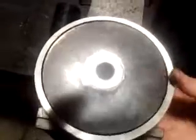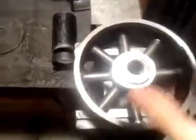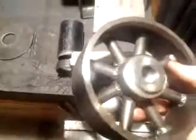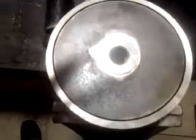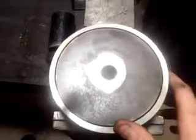I want to show you some different stuff here — it's kind of hard to do this one-handed. I'm going to flip this upside down on the bench. As you can see, the spider design hasn't changed really that much since the first whistles I was building where the languid plate could be removed. But this languid plate now — as I put this in — there's no gap around it, it's not oblong, it's perfectly concentric to the bowl. The steam slot is the same all the way around, it's more prototypical than what the railroads used when they were building whistles years ago.